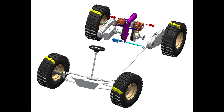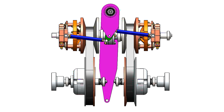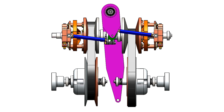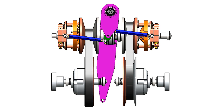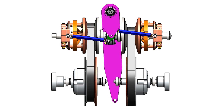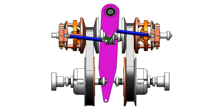The aqua push-pull rod pivots the purple differential arm on its bearing-mounted axis to create a difference in belt squeeze. For a right turn, the right CVT downshifts; at the same ratio, the left side upshifts. A downshift will increase engine RPM; an upshift will decrease RPM. These opposing loads cancel each other out and prevent any feedback to the engine during differential steering. VRD does not load the engine when you steer. Do not be fooled by the simplicity of this drive system — it does what no other system can do.